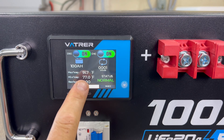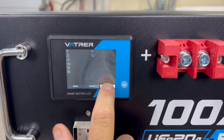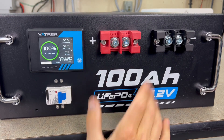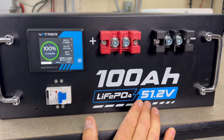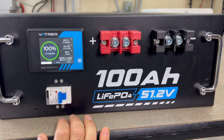The screen describes the battery itself, shows the temperature in Fahrenheit, and displays all the individual cell voltages. We're riding right at the top — cell number three is lagging just a bit behind, so I'll give it another bit of charge before the discharge test. Simple but effective. No communication, just a breaker. I'm not sure if they have a pre-charge resistor on these units, so that's something to look up.